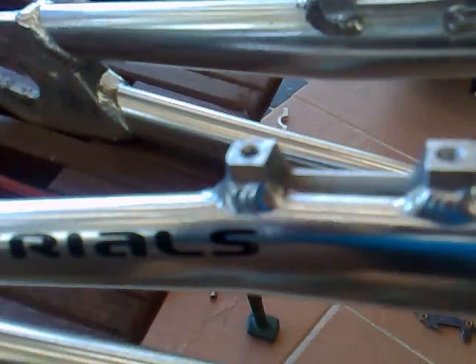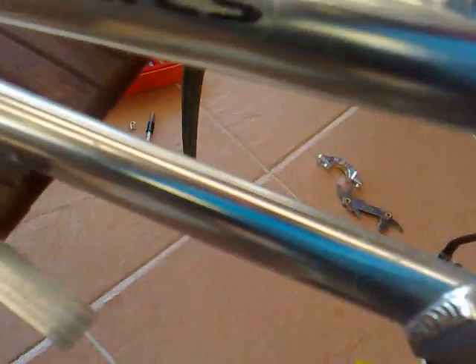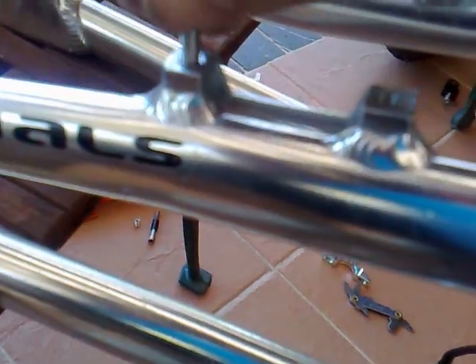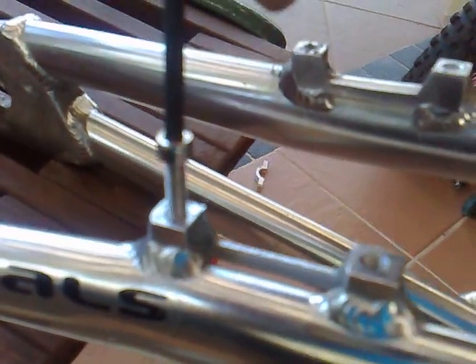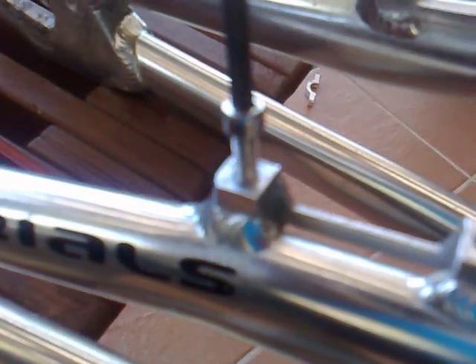The trick is just to give it a good tap with a hammer. Okay, so I broke the tang off the bottom of that helicoil. Now find your appropriate M5 0.8 pitch threaded bolt, which goes as part of the brakes, and just insert that in. It works fine — get a hex key on that. There's just no resistance at all, it's a smooth fresh thread. That is a successful job done.